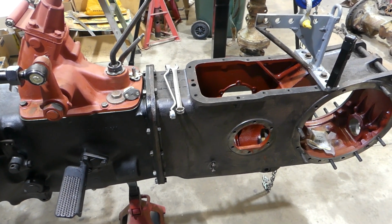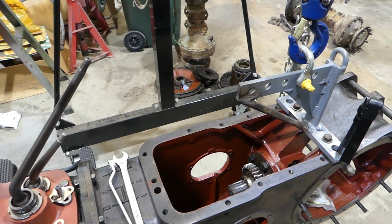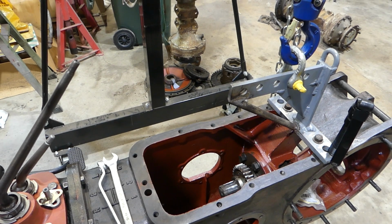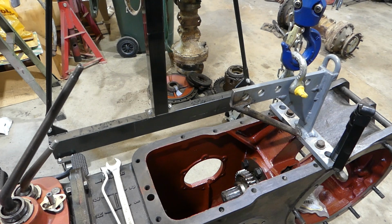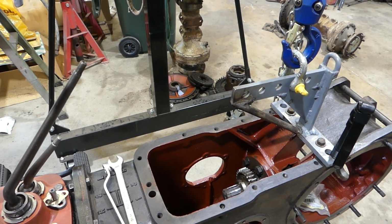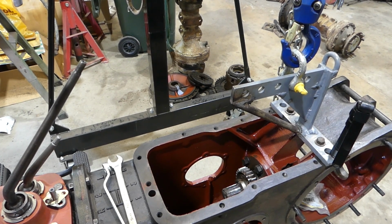So now we're going to move the camera over, and then when we look down the hole there, you can see the pinion. So we're going to try and set the camera up, and we'll just undo the pinion and pull that out. And before we put the hydraulic pump in the housing and the PTO shaft up the back, we need to remove that pinion, replace the bearings and put it back in place.